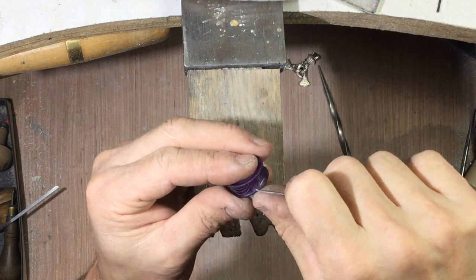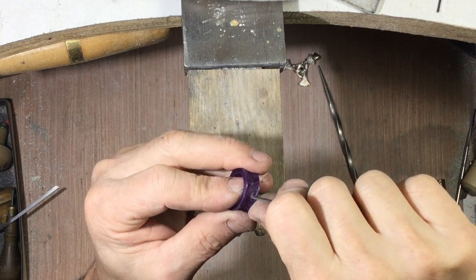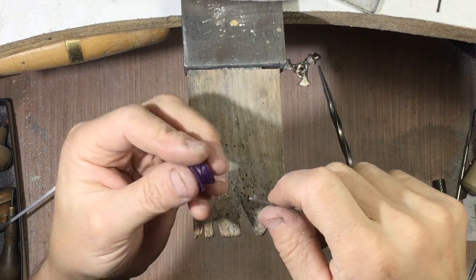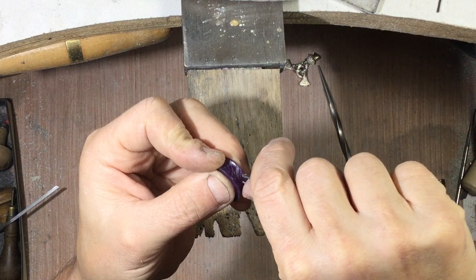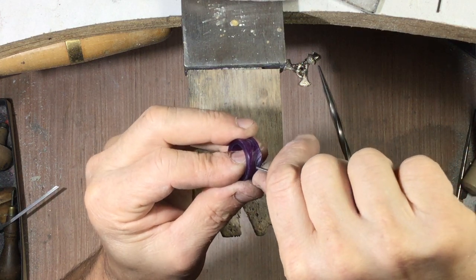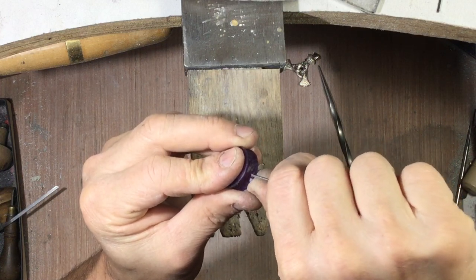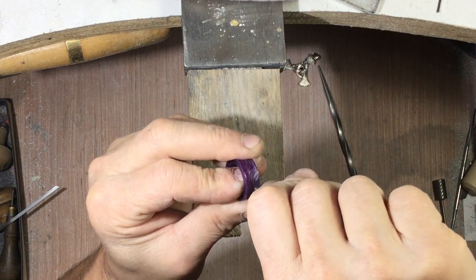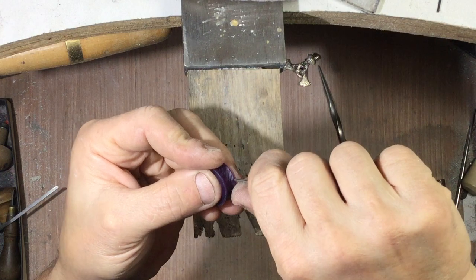I will add the rest of the cuttlebone texture after I carve it, I cast it. Normally I wouldn't do this, because I would just cuttlefish cast the texture. However, in this case, I actually want to demonstrate that it could be done in wax if you really wanted to. You can get a similar texture, but most of the time you wouldn't bother, because cuttlefish casting is actually faster than wax carving, especially for this texture.